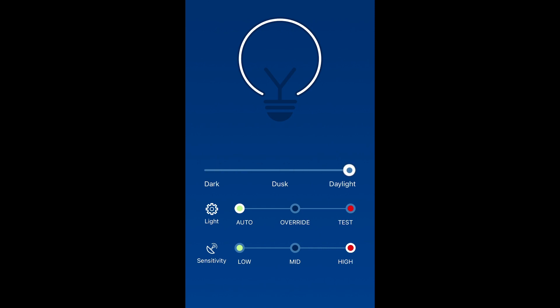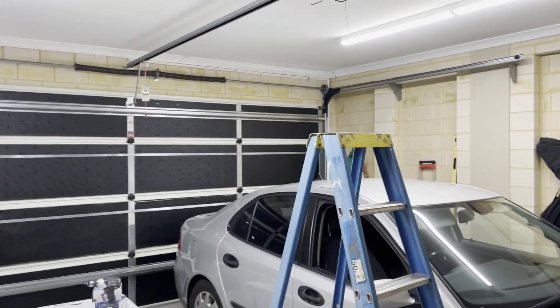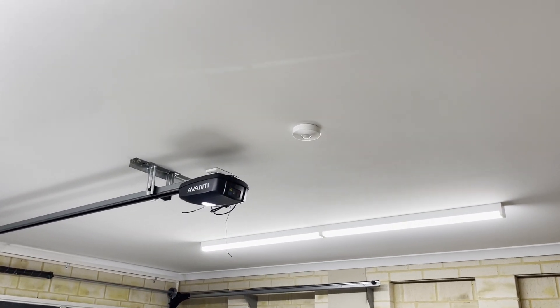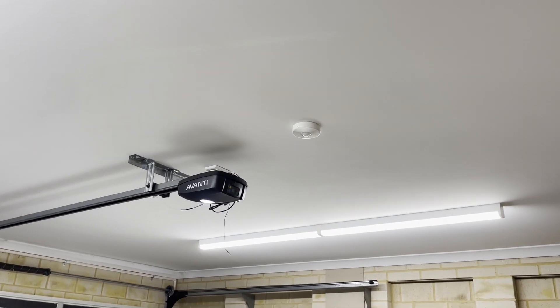We'll put it into auto mode and now it's stopped turning my lights on and off. If I turn it to daylight, it should work again — yep, that's working. So I might just put my garage door down and do a walk test. I'm just about to go into the garage — I've got it set to 10 seconds, sensitivity on high, and it only works in the dark. I'll open the door and go in and see how we go with the light turning on. Well, that works well — it's perfect. I've got a little notification from my Tuya Smart app which I might need to turn off.